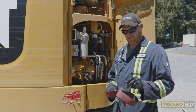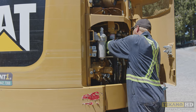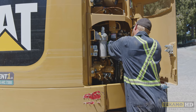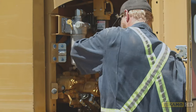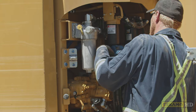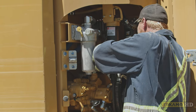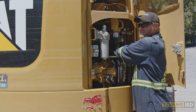Again, I use a strap filter wrench — I'm going to crack it loose. Now that it's loose, I'm going to try and get my trusty little drain pan in here. There is a hose in the way, but we'll see what we can do. All right, we got it set in here. Now I'm going to remove this filter.